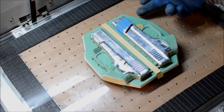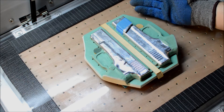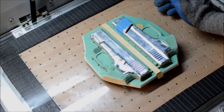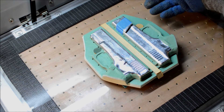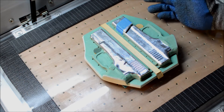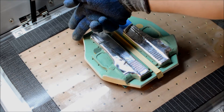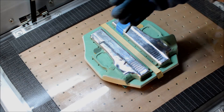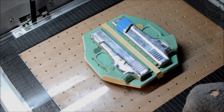While we're waiting, I'll describe another problem you may have — with the membraneless former, you may have heard it's difficult to get the mold out from the kydex once you've pressed it. That's because it sucks it down to every crevice and corner — every detail gets pulled right in. So the kydex is perfectly formed to your mold, meaning it's going to be extremely tight to remove. What I've done is a very precise method of creating draft angles — basically grinding away with a dremel to give it an outward downward slope all around the mold so it pops right out with a couple taps on the bench.